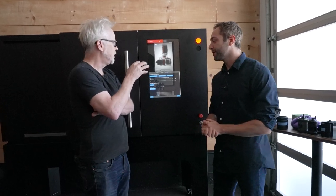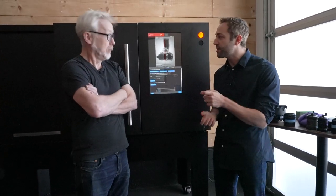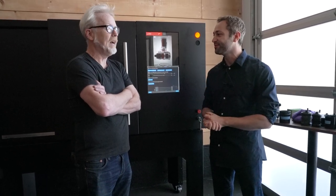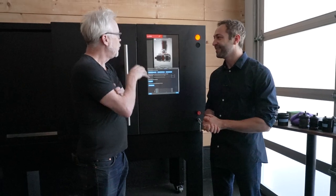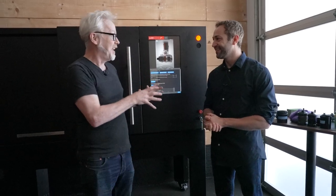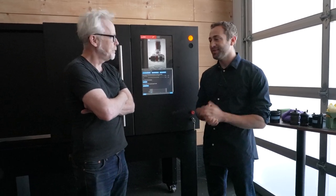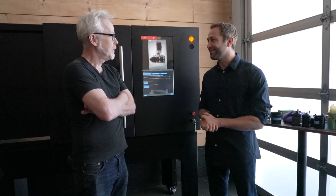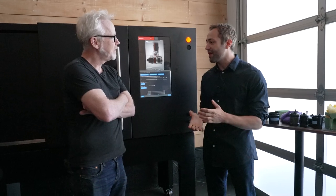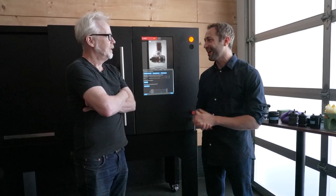What kind of resolution can you get? This machine is capable of 40-micron fine feature resolution — if you're looking at cracks or pores, that's about what you can resolve, and it's a number we're working on bringing down further. So you guys did a scan on my Curta computers — do you know how long the scan took? That was set up as an overnight scan. The higher you climb up the periodic table, the longer you need to be shining X-rays through it. For that scan we ran it overnight — anywhere between 8 or 12 hours — just to get the best quality we could out of those scans.